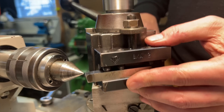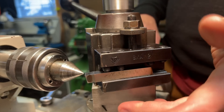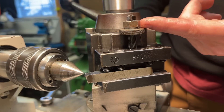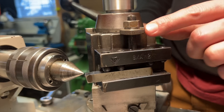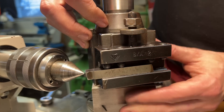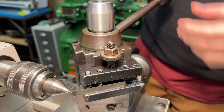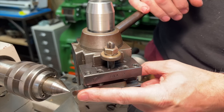The way that you adjust the height of your tool and lock it in place is pretty much the same on all quick change tool posts. There's a threaded post in the middle of the tool holder, a knurled knob, and a locking nut. There's usually a washer between the knurled knob and the locking nut — sometimes a wavy spring washer, sometimes just a normal washer. You use the knurled knob to raise or lower the tool, then cinch down the locking nut with a wrench. This tool holder is then set until you change or resharpen the tool.